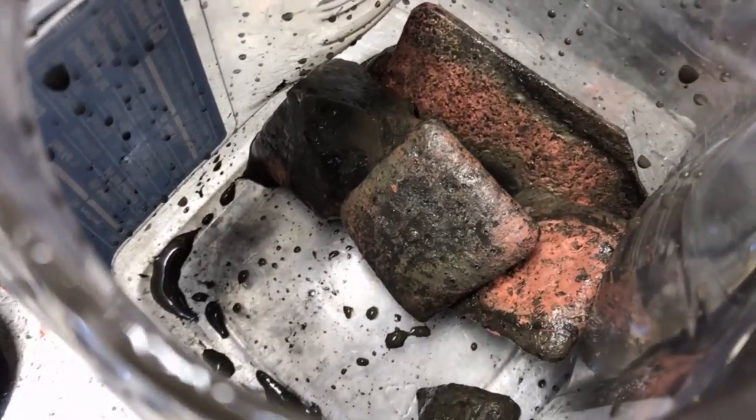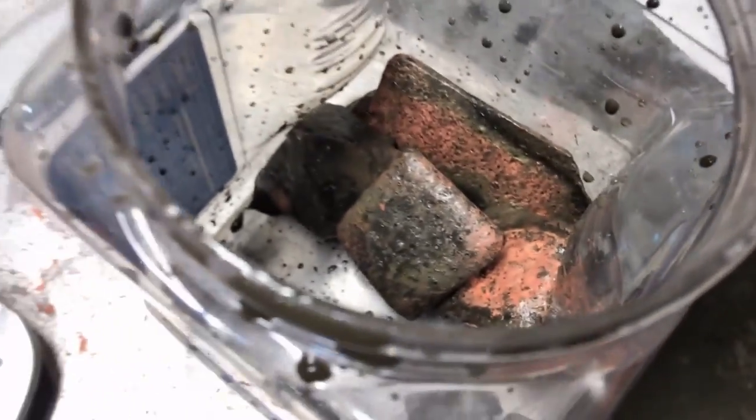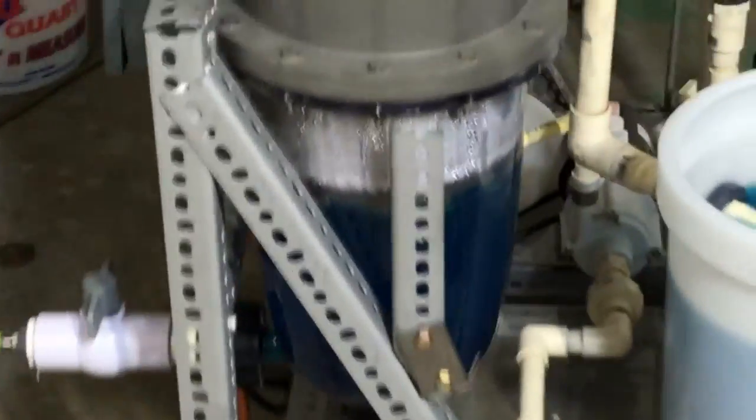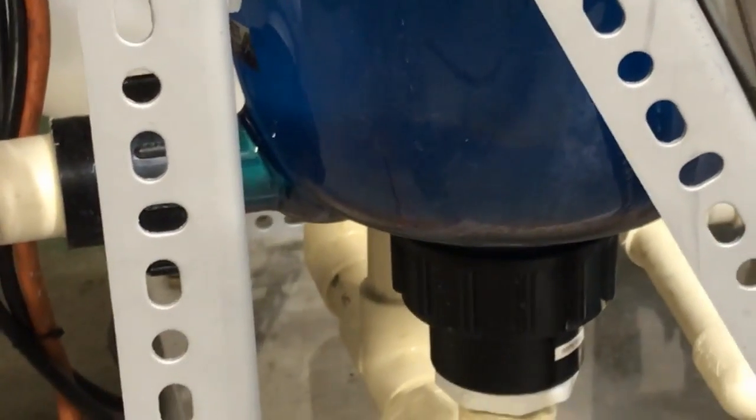I'm going to run this stuff through another wash to get the rest of that anode mud off of it. I'll probably end up melting this down again and turning it into shot — I just wanted to do a test to see what larger pieces do. Turns out they work out pretty well; they allow a very high flow through the anode. I have not had a chance to harvest the anode sludge at the bottom of the cyclone yet. I'm going to wait until all the testing is done, because it's easier to get a large amount out of this thing versus a little bit.